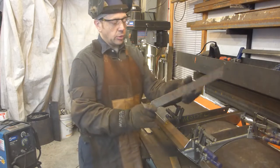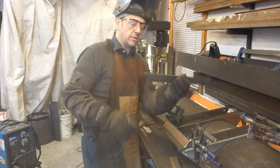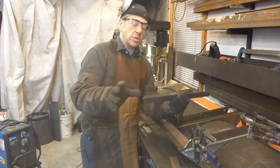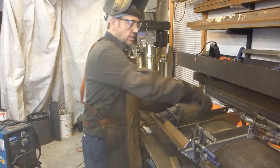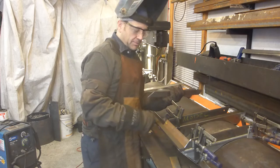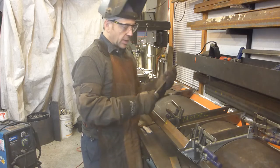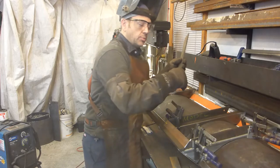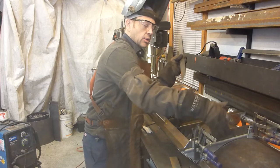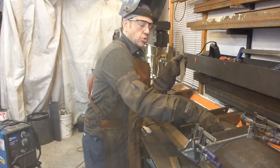We've used one of those models, and we have used that in the previous video. This is the model for the skid steer quick attach system: 45 degrees, 60 degrees, and specific length. This is our model. There's a hole in it. It's a hidden model, so we keep it for future projects. And we've got two pieces out of that. The first one is already in place. It's 1/4 inch within the frame, which was calculated.